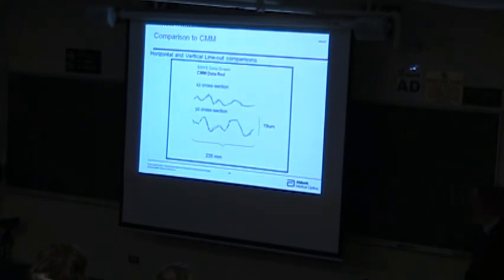And then I think this is a final comparison of those. Like I say, these mirrors are now all finished. That instrument was designed to have very large dynamic range, but its best accuracy was about a half or quarter micron. All those mirrors now are down to a 60th of a wave, so this isn't a useful instrument for that anymore, although we could probably upgrade it with a visible one if they wanted us to. And I believe NASA is doing a full-up test where they're assembling the entire satellite in a giant vacuum chamber in Houston, where they're going to do a 100% test of this, because they're not going to have that particular problem again.